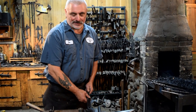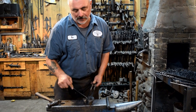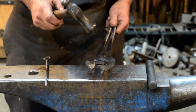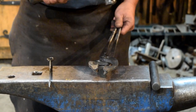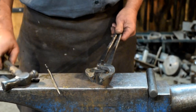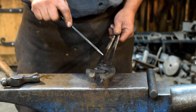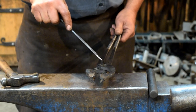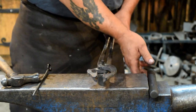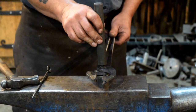While that's heating up, let's go over the riveting process. First, make sure your rivet is in the bucking tool and that your two pieces being riveted together are tight — no gaps. Take your ball peen hammer using the face of the hammer and use vertical blows. We're trying to upset the rivet, making it shorter and bigger in diameter. When we get about halfway, we switch to the peen side of the hammer and work around the outside edges to shape it like a rivet. Then when we're about three quarters of the way done, we grab our heading tool and put that on there to dress up the end of that rivet.